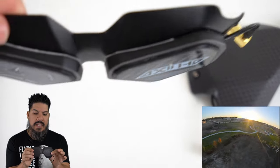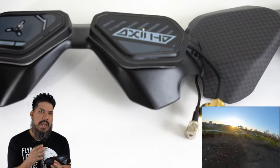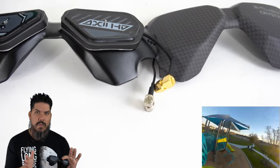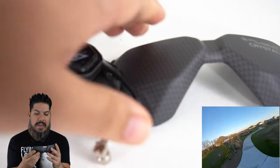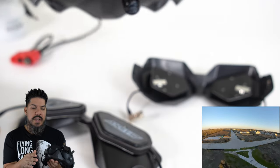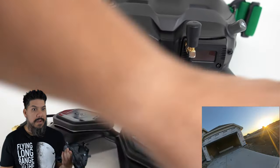As for antenna angle - with the Axie HD you're essentially placing the angle yourself, but it's laid out similar to the shape of the faceplate so it should be fairly repeatable. They're slightly angled to give you a nice wide beam capture with both antenna elements. The iFlight Crystal has a similar spread. Honestly though, the TrueRC stubbies are going to be the smallest option, so my preference is to run one of these patch antennas along with TrueRC stubbies at the top - that's kind of the 'Johnny five combo' I talked about last time.